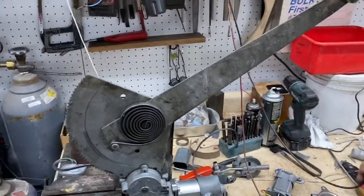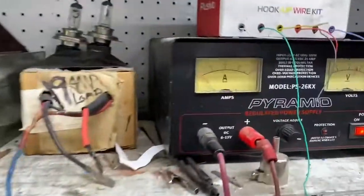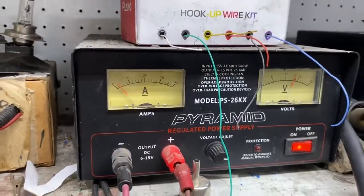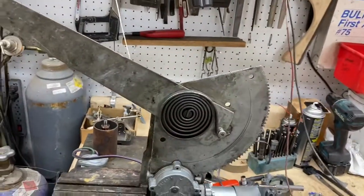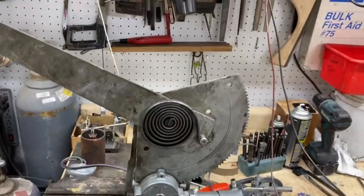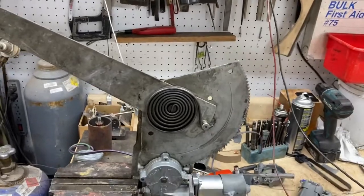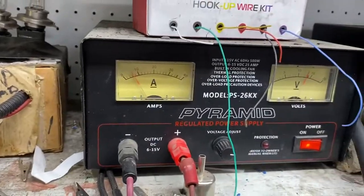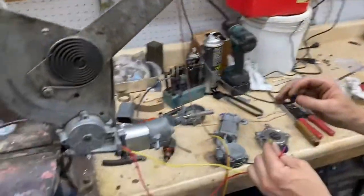In the meantime, go ahead and run it again and I'll show the amperage draw on this unit. Going with the spring, it's just like running free or better — we're assisting the motor. There was less than an amp and a half draw. Now against the spring, you can see we're drawing just about five amps.